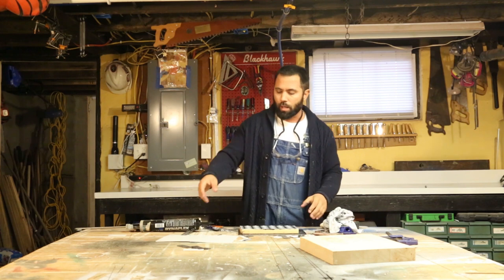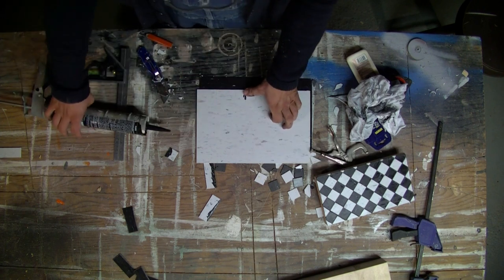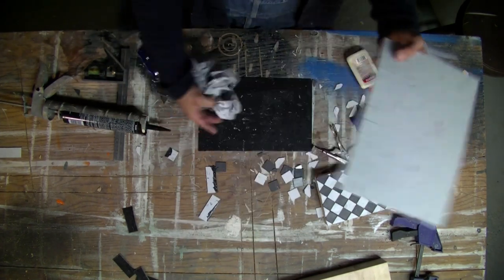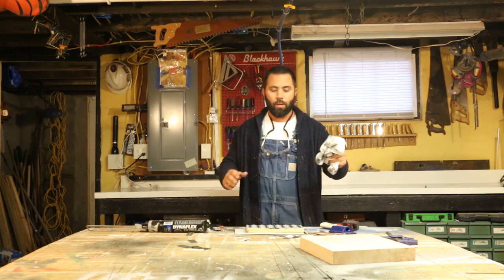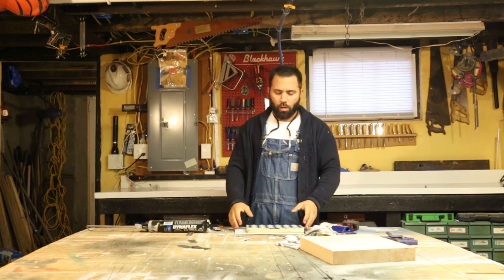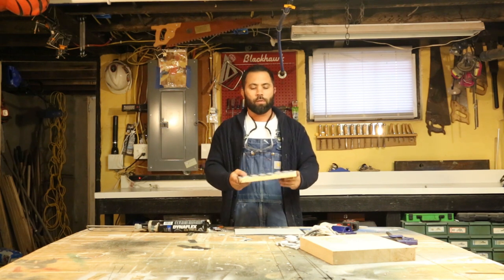You can use white caulk — let's say I had this little trick on the plain white tile. These cuts are left through, you press that in there, it makes them nice and dark, so if you did that as a grid it would look like black grout — or conversely white on black vinyl. So folks, you've got yourself a nice VCT floor. Hopefully there are some tips in there that are useful to you — the little caulk trick comes in all different colors and shades: tan, white, gray, beige, almond, what have you. Express yourself with caulk. VCT comes in so many different colors and types — you can use different laminate floor tiles that look like wood and make yourself a little parquet floor. There's a lot of different things you can do with this technique.